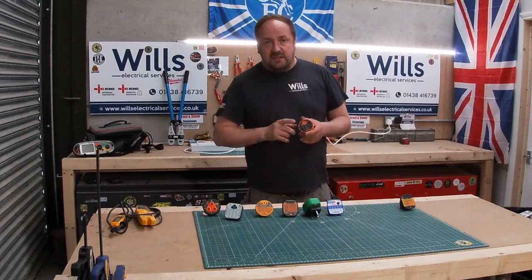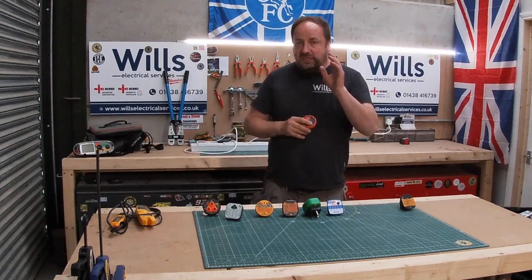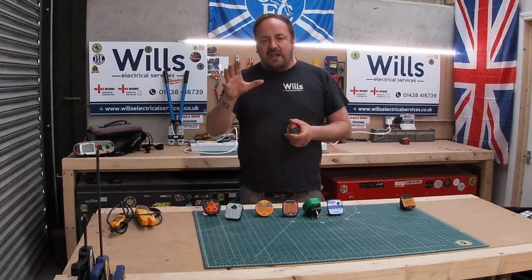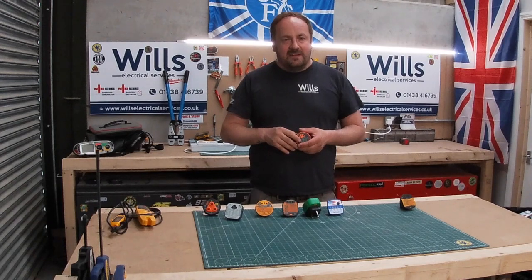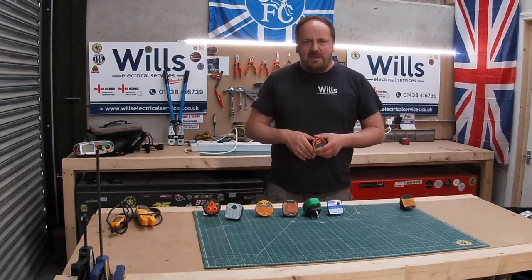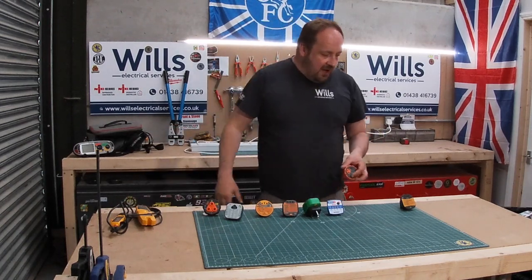One thing that is worrying is that I watched a video of these, because I didn't realise how much some of these do, as in they've evolved. They've got a top of the range one which is hilarious, and it says it's the Part P one. It's a socket and see and a plug top thing, and it's advertised as Part P. It also says it does an RCD test, which comes out as pass or fail, which is hilarious. And it's also got earth loop impedance, where it comes out good, bad, or not. You know what I mean? It's just obviously talking to you as if you know what you're on about with the testing. So that is just criminal. It doesn't even make sense. But, hey-ho, it is what it is.